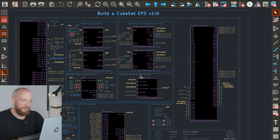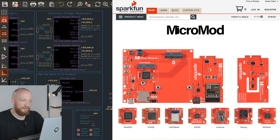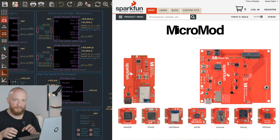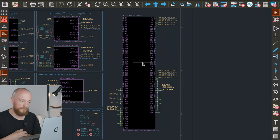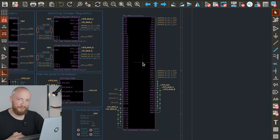Let's look at the PCB stack connectors next. I got inspired by SparkFun's MicroMod ecosystem — a line of products where they sell microcontroller boards and function boards connected on a carrier board using M.2 connectors. I kind of like the idea of using an M.2 connector with a different pinout and adapting it to a specific use case — that's what I'm intending to do with the PCB stack. I'm calling this Macromod for the moment, but if you have a better name, please let me know.